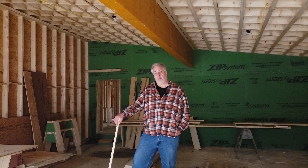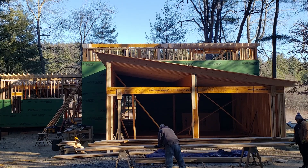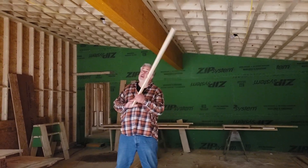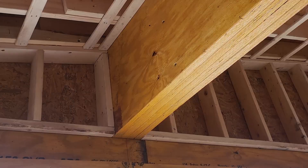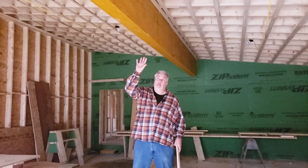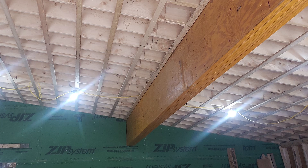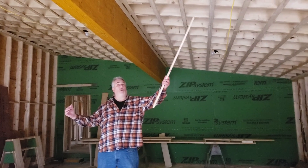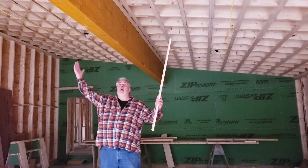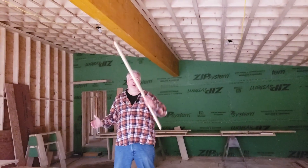How did we frame this roof, and how did I plan for it? So you can see I'm in a standard two-bay garage. It measures, I think it's like 26 by 28 feet. Two bay. You can see above me here with my handy dandy pointer — we have a quad LVL because it's a substantial load here that's going back this 26 feet. So it has to be a sizable beam. And understand that that beam is carrying half of the roof load. So we have an exterior wall there, but the exterior wall only carries half of the left span here. That exterior wall carries half of the right span. The center middle of both spans comes into this beam and has to get carried there.